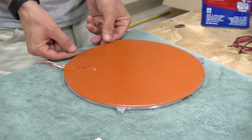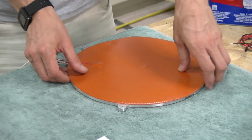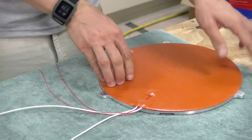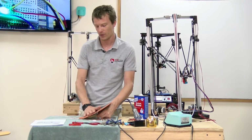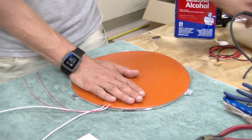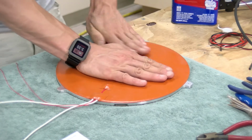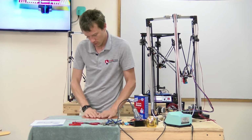So when it's just grabbing by this folded down edge here, you can align it perfectly, run your fingers around the edge to make sure you have the same amount of overlap. And when you get it just so, really push down the part where the adhesive is revealed, and that will anchor it. And then you can flip it up underneath and grab the paper. Be careful, don't bend this too much. There's a whole delicate circuit board in there. So kind of keep it as flat as possible. And you can just pull the paper out like this, just like so. And then carefully and deliberately work your way around and get out any air bubbles or pockets, and make sure it's fully attached all over. There. Great.